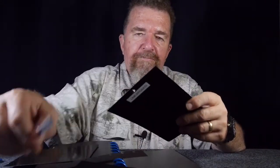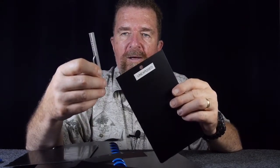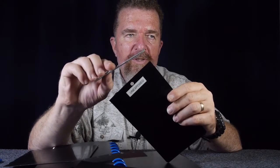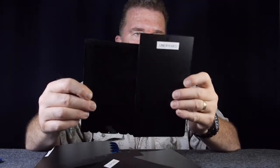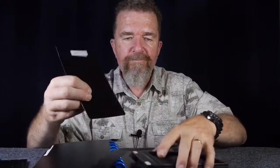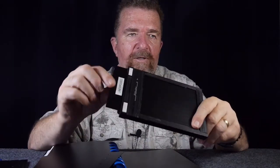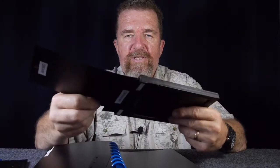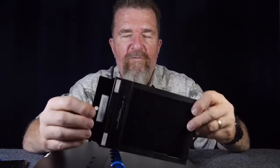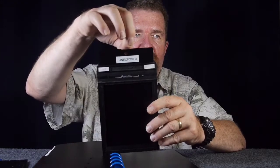I didn't think it would work to drill tiny little holes along the edge and try to use the metal strip, because this polypropylene plastic is really not strong enough, plus you'd have to re-crimp the little aluminum channel to get it to work. So instead of making them the original length, I've made them a little bit taller — a little bit longer. The way it works now is you insert the dark slide into the film holder like that, and you have a little handle that sticks out. Both slides have a hole in the handle part that helps you pull them out.